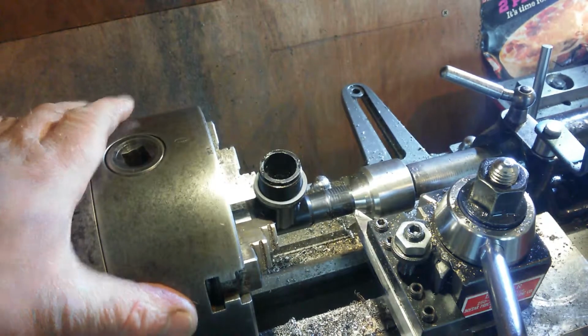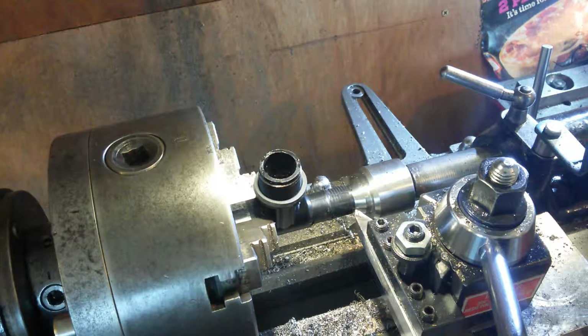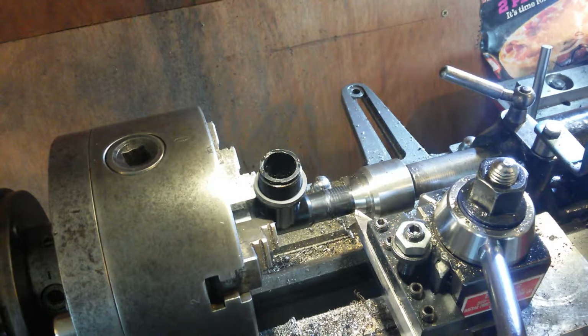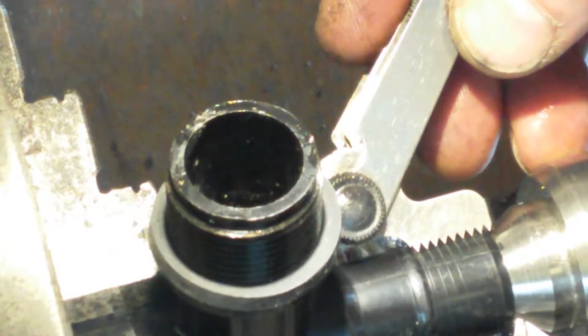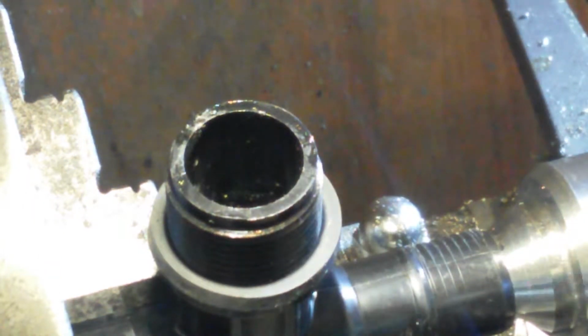And we'll check, see if that's 14 TPI. So I've got my 14 TPI gauge here. I'm not sure if you can see any of the scratch marks there. I'll zoom you in. How's that? Because it'll fit the other way. And we'll just see if that's 14. Looks very 14 TPI to me. So that gets them. Now I can gauge this. I'm going to try this, so I don't know. Let's just do it standard. Keep it nice and standard.